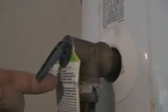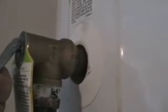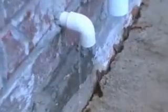And once you have it on for like an hour or so, you can then test the pressure release valve, and the way you do it is just hold it like this, and you pull it a little bit. You're going to hear the sound of water being released. You probably heard that. Okay, and what that does again, it releases water down this new pipe that I just repaired. And if I go outside, I should probably be able to see the water coming out. Yep, and you can see how the water is now coming out.